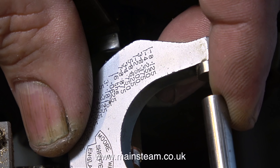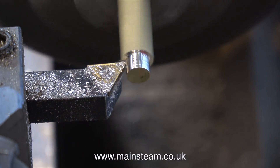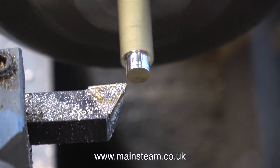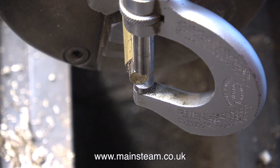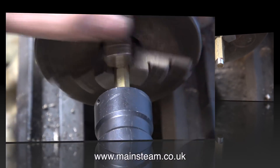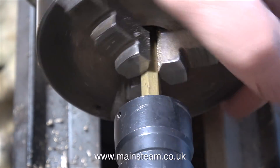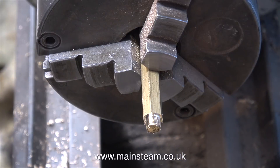This is my old micrometer and I'm just checking that it's set to 0.250, which is a quarter of an inch. I'm going to cut this part of the metal bar to a quarter of an inch in diameter. This is a piece of hexagon brass, and I'm going to convert this very plain lump of hexagon brass into an exhaust adapter — 3/16 by 40 threads per inch to a quarter by 40 threads per inch. I'm machining and threading the quarter inch side first, then once it's parted off I will reverse it in the chuck and machine the other side.